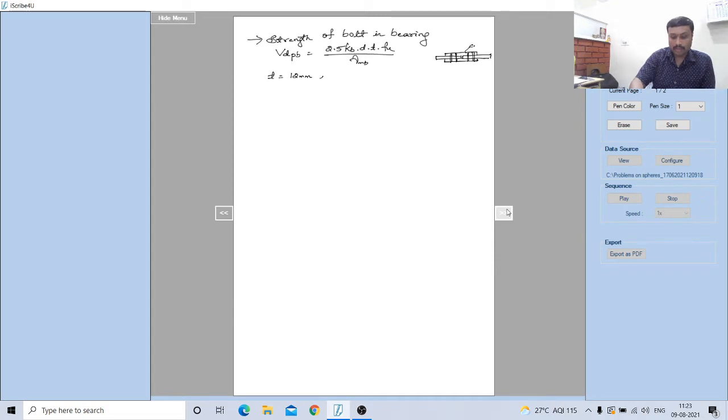So this is cover plate. This is main plate. Obviously, your cover plate should be lesser than that of the main plate. How much should I take? So what you should do is, for cover plates, generally what we suggest is thickness will be 5 by 8 times of the given main plate thickness. So 5 by 8 times of the 12 mm is 7.5 mm.